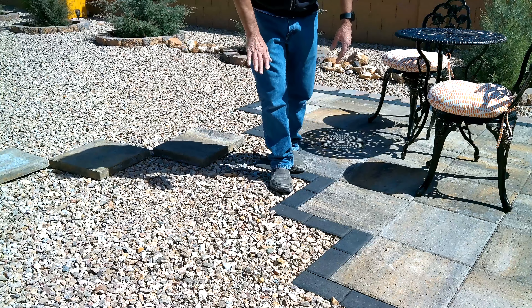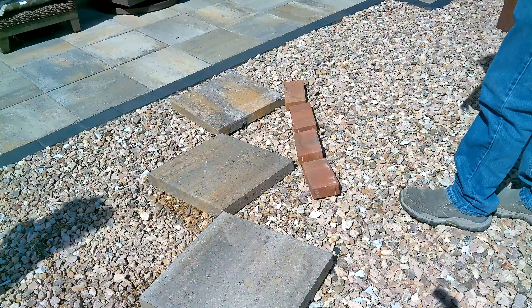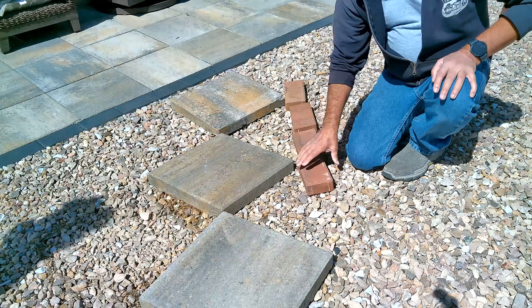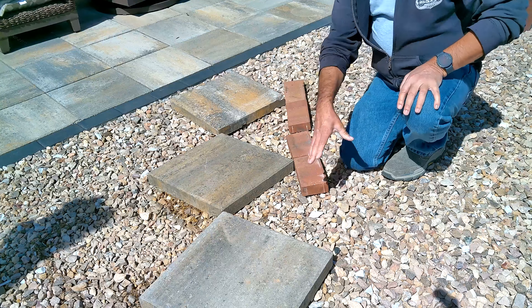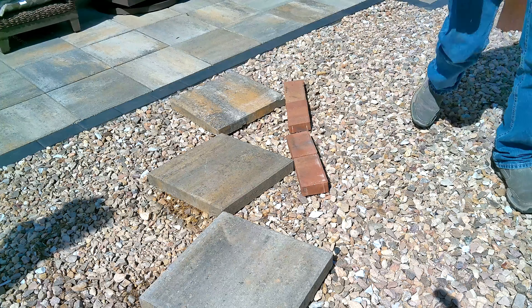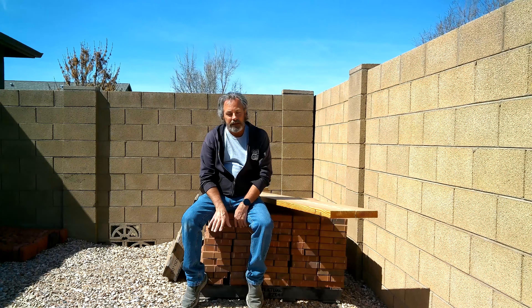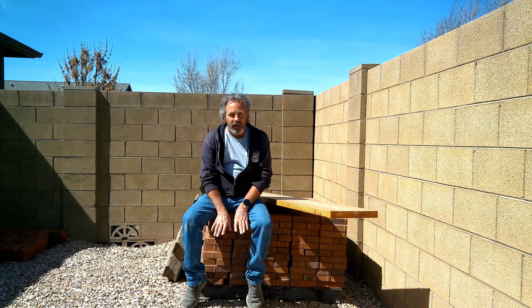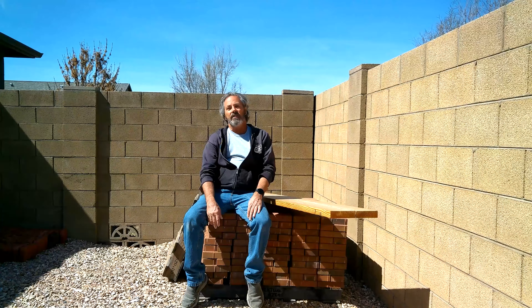The corners in between will have a row of pavers running here that will be mounted in cement with the rock in between. So this rock shouldn't move — the pavers will stay in place and they won't move at all. The short description: pavers like this all the way down the sides, right to the corners of the big pavers, and those will form the side of the walk all the way up. These are our leftover smaller pavers. We bought these because they were very inexpensive, and since we're staining all of these a different color anyway, it doesn't matter what color we get. These were $0.23 each on sale, clearanced off — since we don't care what the color is, they work perfect.